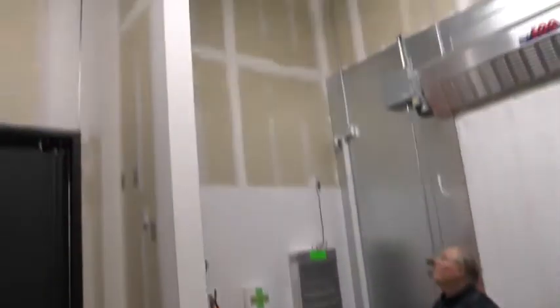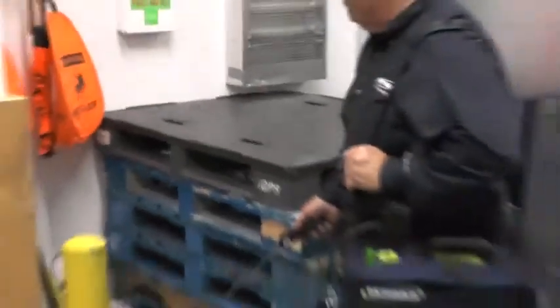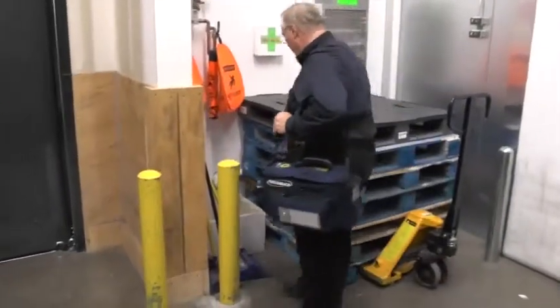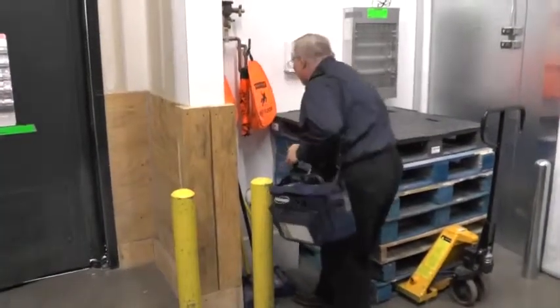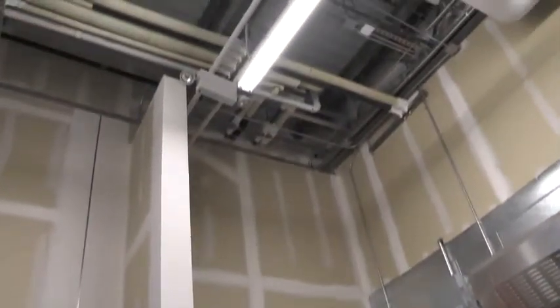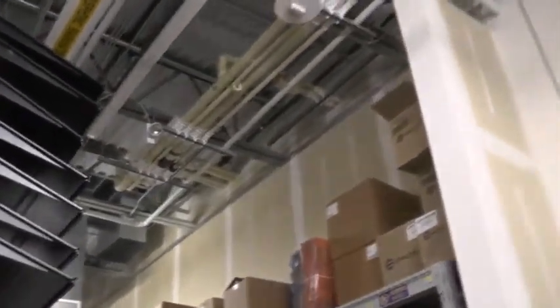One of the items we'll have to deal with is the overhead lines that go down and inside a soffit wall, before they go into the backs of multi-deck cases or down into a pit for coffin cases on the sales floor. If you suspect a leak, you may have to cut a hole in the wall to leak check inside the wall, and work your way up to the actual line set in the steel. Bring in a scissors lift to leak check the line sets, expose the actual copper piping, and cut holes into the insulation to leak check from there — looking for oil and any leaks.